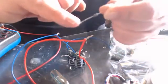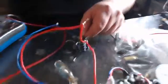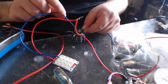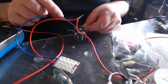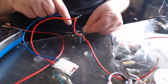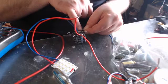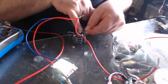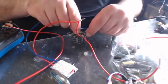So now we're going to plug this side to the center cap, positive, and we're going to shoot it like that. You see how the light's lighting up now. That's when I connected to 1. Now, is it 1? Let me just make sure of that, because it gets tricky for the eyes. Okay, yes, that's just 1. And I do that, and it works. That means that the center cap is now also one of the exterior caps in parallel to it. It's crazy, yeah? But when you think about it, that's what's going on. Now it's like this one became the center one. If I put it here, it's going to be like these two are not only part of the exterior, but they're also part of the center. Let's see what it does.